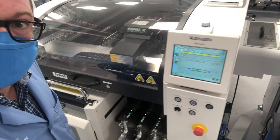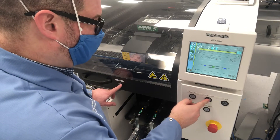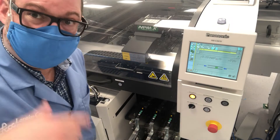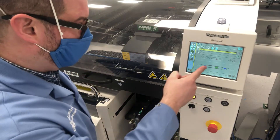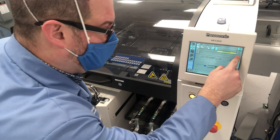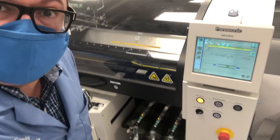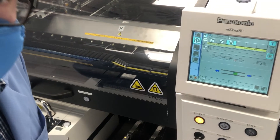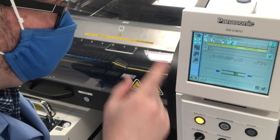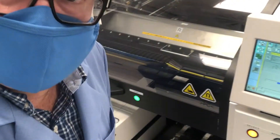There's a nice way to handle this on the Panasonic pick-and-place. I'll hit activate again so we can resume the cycle from where it left off. The heads snap right back into action. I'll hit the cycle stop button, which waits until the current board is completed. You can see the board getting to 204, 207, 210 parts — and now it's paused.